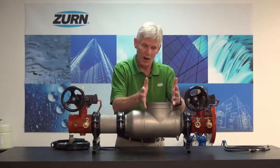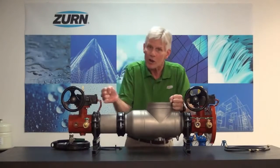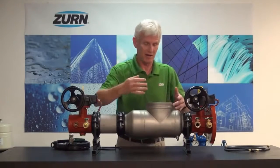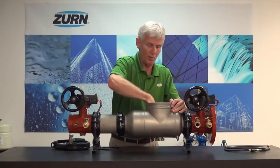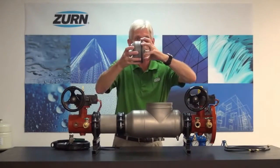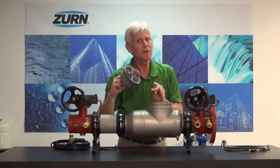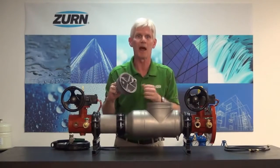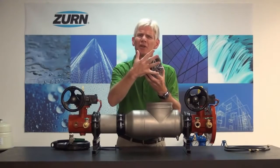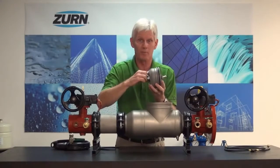So again, when you want to take out any one of the checks, make sure that all of your test cocks are open. That way you're not trying to pull a vacuum when you're removing the checks. So again, I'll go ahead and take that test cock open, and we'll go ahead and pull out the number one check. Now they're pretty straightforward. They're just setting within their bore, about like you see here, and you simply pull on the handle. But one thing that can happen, and it can make them difficult to take out over the course of time, is when we get calcification and basically just minerals from the water plating around that check. It can make it very difficult to remove from its bore.